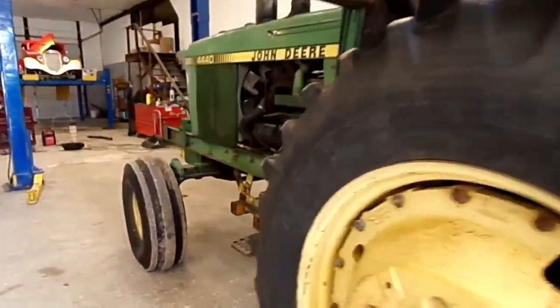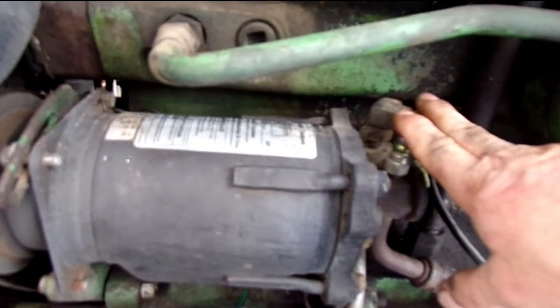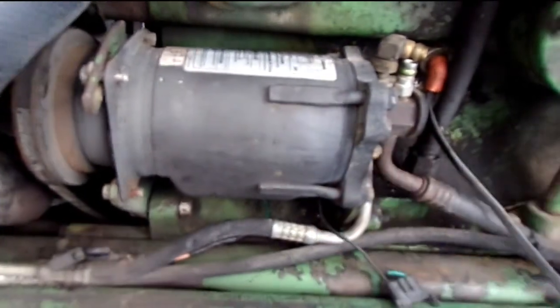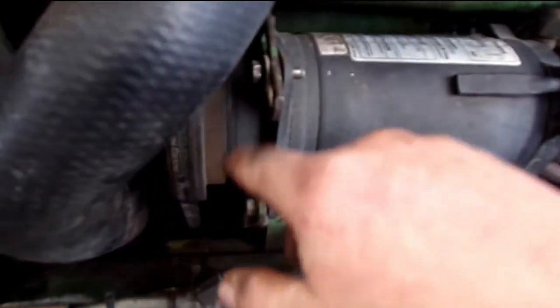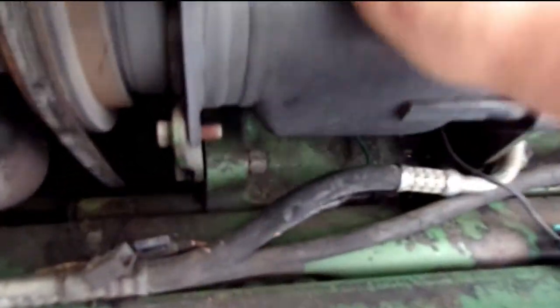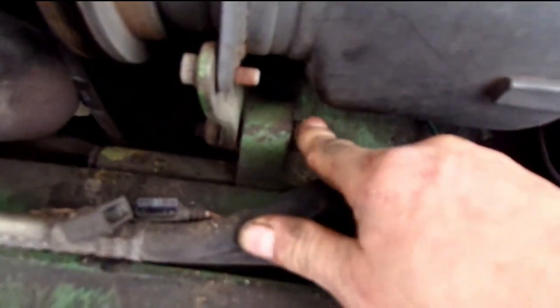Let's start tearing it apart. First thing we're going to want to do is remove the old Freon and reclaim it. But in this case, when this hub shaft came out, that seal in front of the compressor lost all its Freon, so we don't have to reclaim it. We'll remove the hose lines at the back of the compressor, then remove the half-inch bolt and the three-quarter-inch bolt where this swivels, take the belt loose, and slide this compressor out.